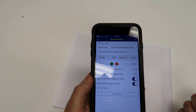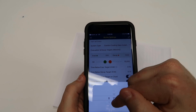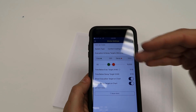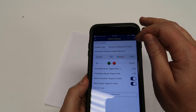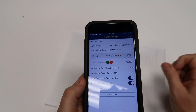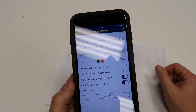For a lot of manufacturers, that decay target of 1000 is similar to what they suggest. Carrier, for example, has a guideline of not decaying over 1000 after a 500-micron vacuum in 10 minutes. Jim Bergman suggests using 10 minutes as the baseline and adding a minute for every ton — so this would have a 13-minute time below decay target. For comfort cooling on new installations he suggests pulling down to 200 with a decay of 500; for comfort cooling service he recommends an evacuation of 500 and a decay of 1000. We actually did better than the recommendations.